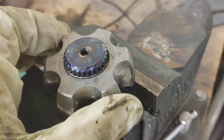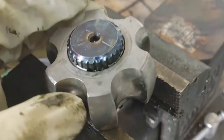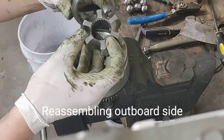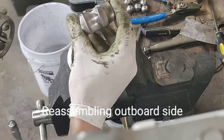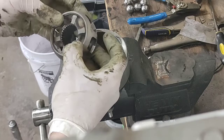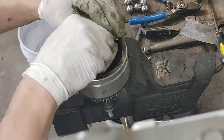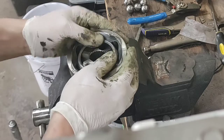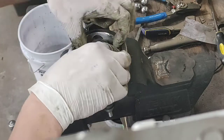This is what it should look like if it's nice and snug — this is going to be reinstalled lastly before the boots go back on. Hopefully you're watching this video before you begin disassembling your old CV shafts, because there is an inside and an outside to these pieces. I would suggest taking some pictures as you disassemble your old ones to show which sides are inside and which sides are out, or stamping them with a punch on the end of the races so you know which sides are what.